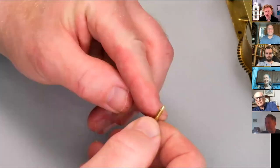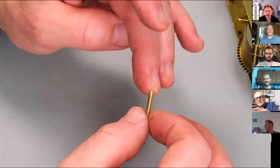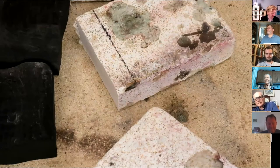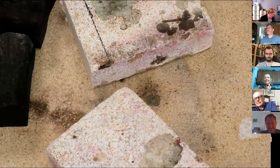Now our rivet, which wants cutting off now, is drawn wire. So it's kind of relatively hard. It's a funny material, but it's quite sticky wire when you turn it. So I'm gonna cut it off and then I'm gonna anneal it. Probably doesn't need to be done, but as a demonstration, that's one of those things that you can buy, or as you start with very few tools, hand tools, and then begin to build a workshop to do things like soldering. We kind of do soldering nearly every week, it seems, at the moment. Everybody loves it, because I usually set fire to something, my jacket, back of my hand last week on Thursday. So it's a good laugh. All right, I need to cut it down first, actually. So we'll come back to heating in a minute. But that piece of brass is remarkably easy to manipulate to get it to do what you want it to do.